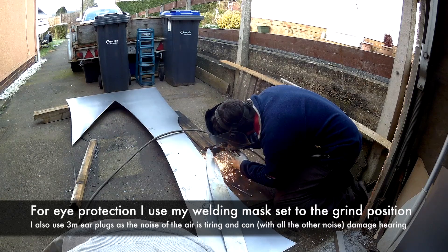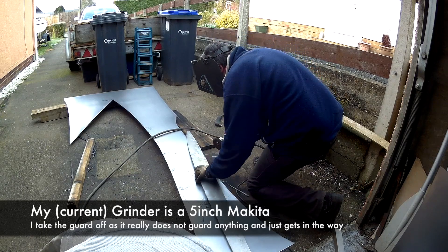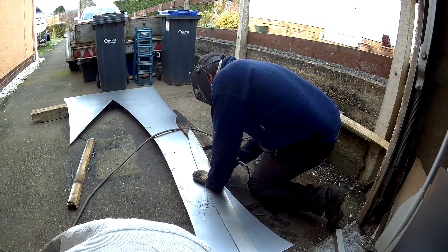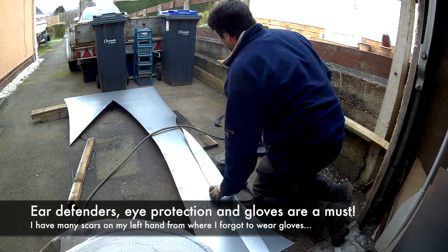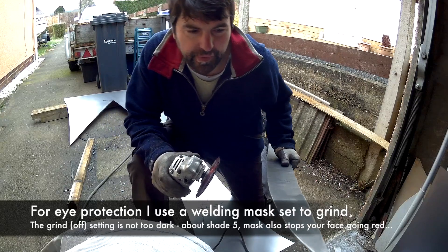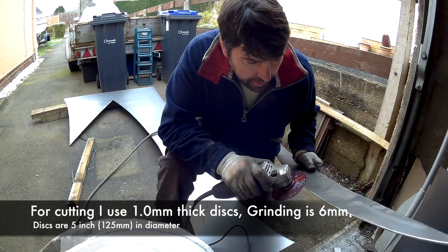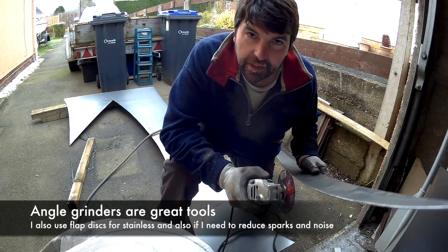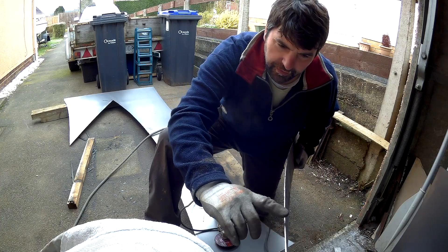It's a really cool system. I've used oxyacetylene a lot before and this is just so much easier to use. With the plasma cutting done, you shake around a little bit and don't get quite a nice straight line. Also the compressed air has forced the metal out and sometimes leaves a bit of slag which you can usually just hammer off — it's actually a really satisfying thing to chip off that slag with a little hammer. But then I have to grind it nice and flat. With a wavy line I tend to grind one side then the other, and because the grinder naturally does more on the bits that stick out, it makes it straighter quicker.